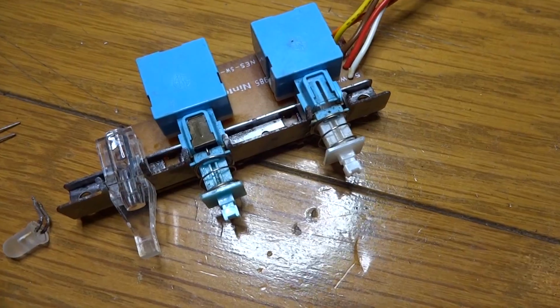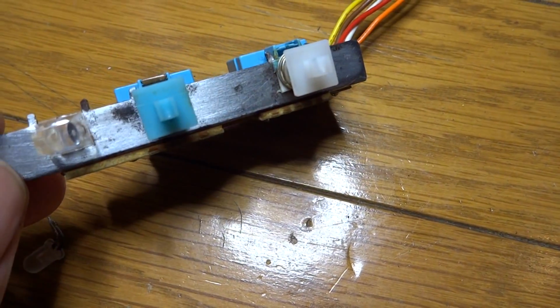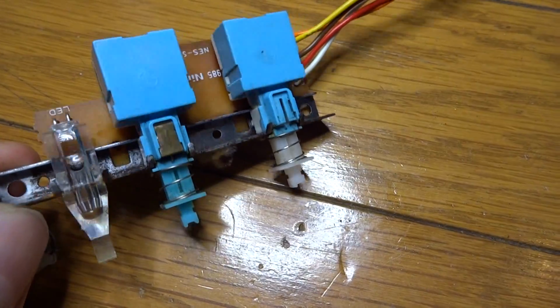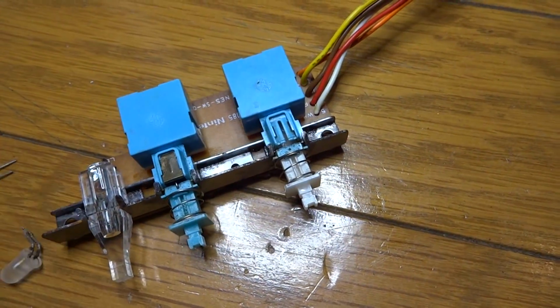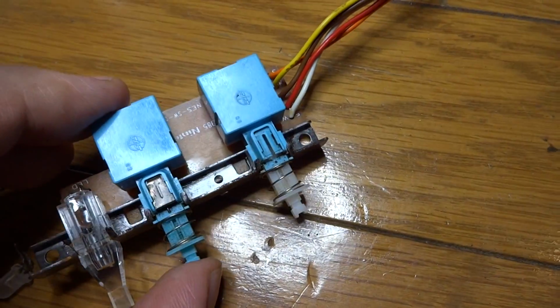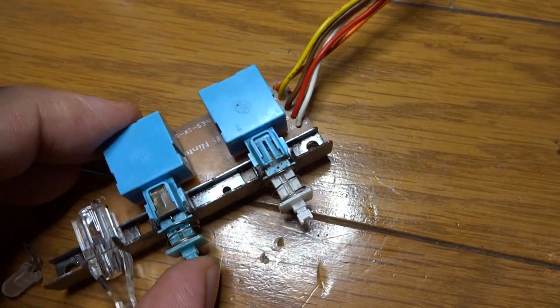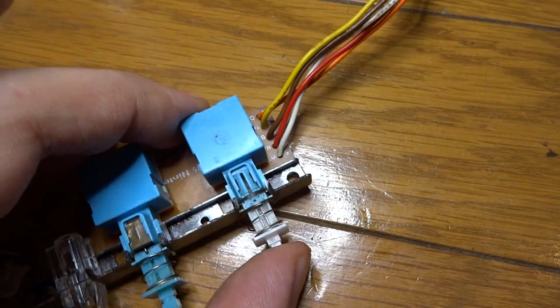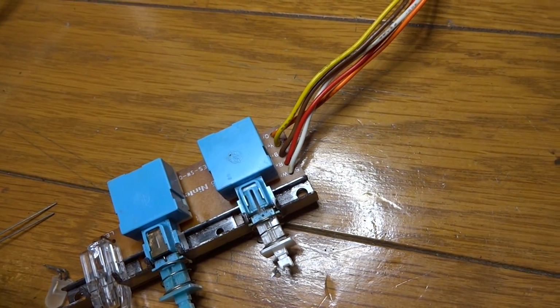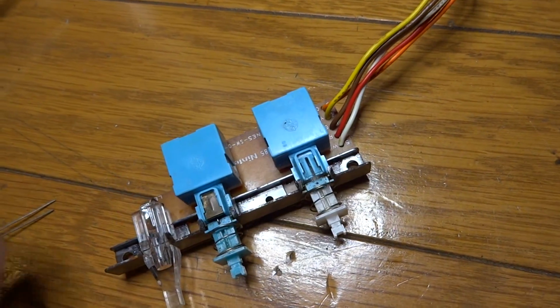Okay, so another thing, as you can see here, I had to go and polish up and repair the power and reset button switch area. This thing had a lot of problems. The switches were a bit locked up and weren't making good contact, so the power switch, I went and stripped that down, as well as the reset button as much as I could. Tried to make sure the contacts are making good contact.